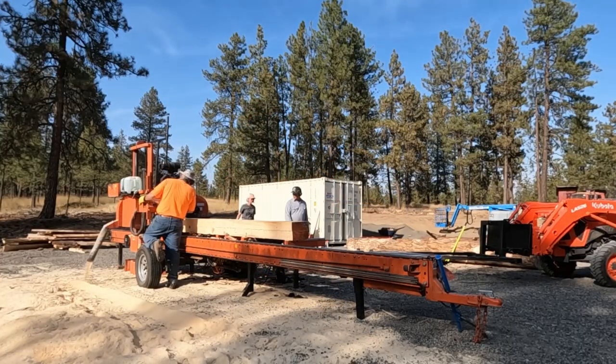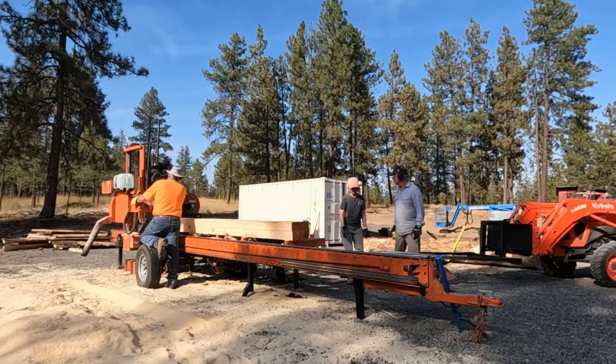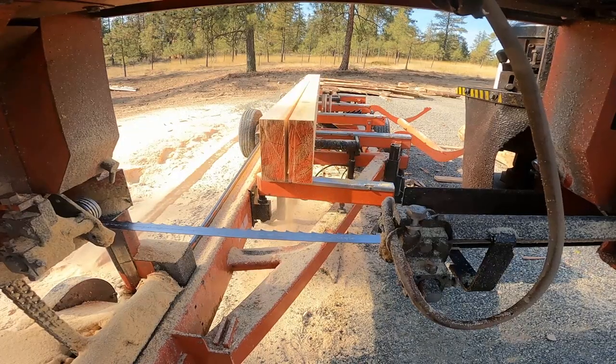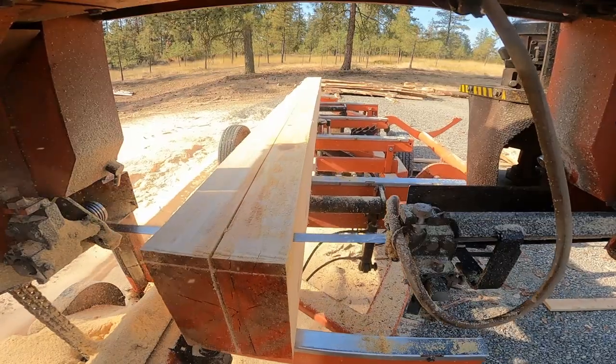And you'll notice I was above the pith right there. I always talk about not hitting the pith. You just don't want to split the pith on the log. It's very inferior. It's not even really wood. And the young wood around it is weak wood. And so you want to try to capture that into one piece of wood, one board.